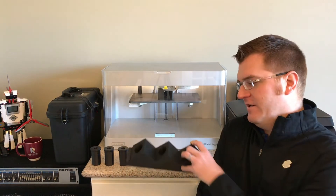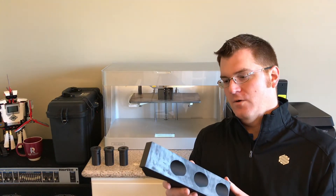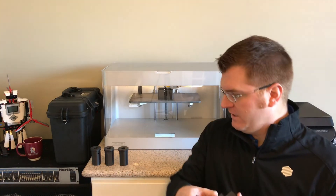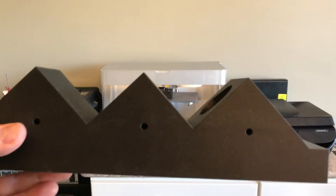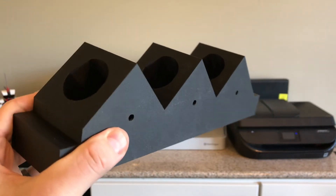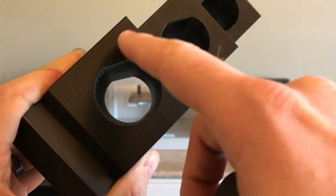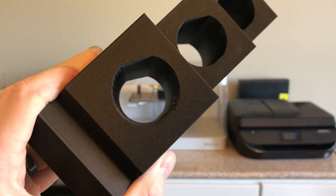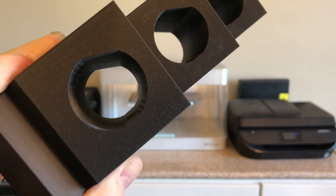The reason I'm here today is to show off another sample that we made. This is a grinding fixture for some carbide pieces, and what it's got going on is three bores on the inside and these three liners. We've got this large block which took up most of the build plate, and as you can see in this bore, it is round with a flat on it to orient the part. That would be very difficult to build with traditional subtractive techniques.